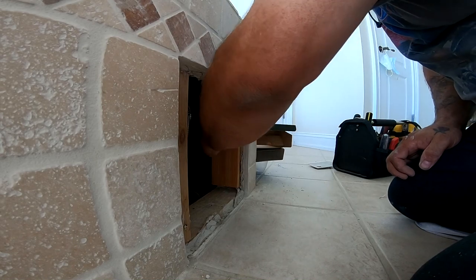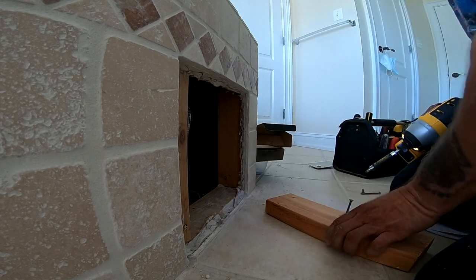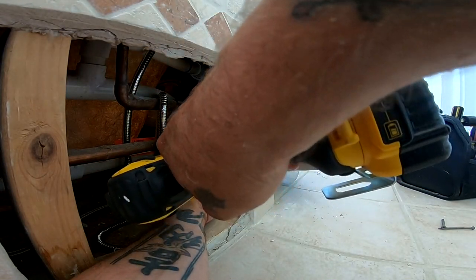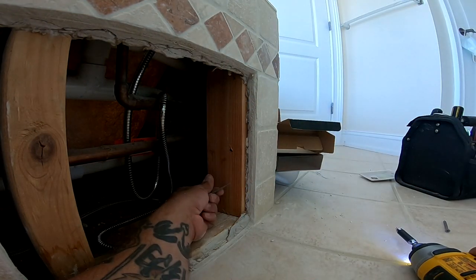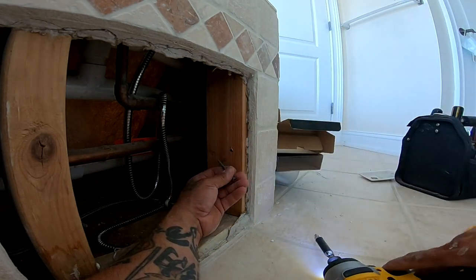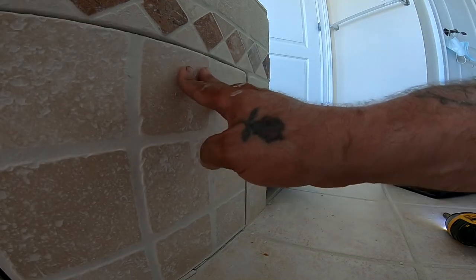What I've done here is cut a piece of 2x4 twelve inches long and I'm just going to screw it to the existing 2x4 on the right-hand side of this hole. When I cut the access panel, the panel when it goes back has nothing to sit against on the right side. By putting that in there it acts as a little cleat — there's a half inch there and the access panel can rest against that, so it's nice and firm once in position. This way it can't be pushed in; it has something solid. We don't even really need something at the top, just that right there.